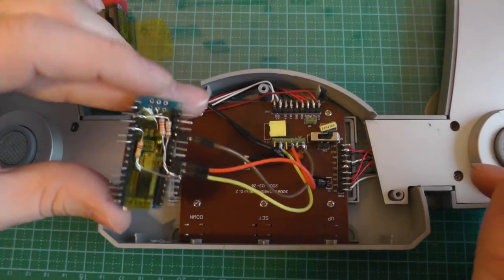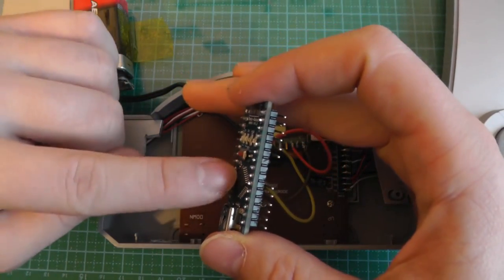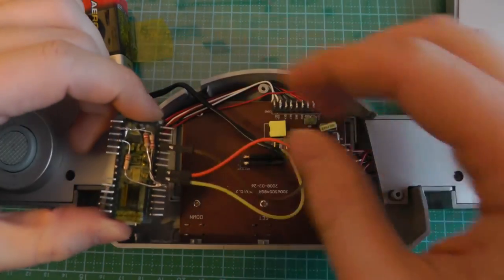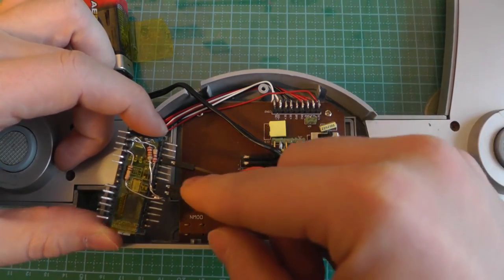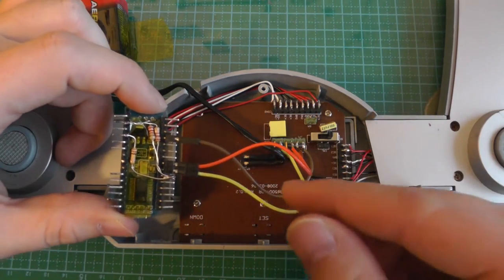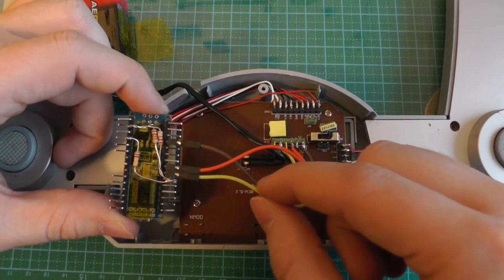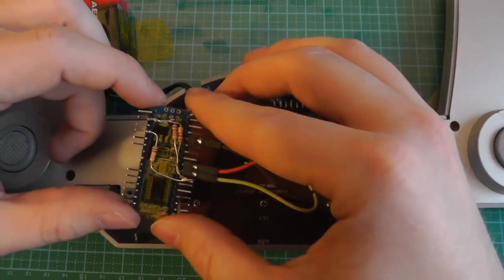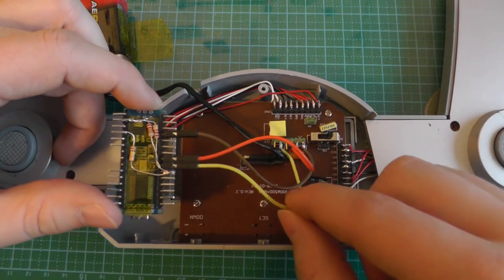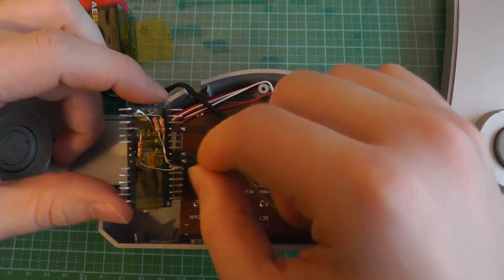This Arduino Nano operates at 5 volts, so the pins on the Atmega are at 5 volts. Now we've seen that this signal is 3.3 volts, but 3.3 volts crosses the threshold, so the 5 volt pins still detect that it's high. But the problem is that the 1 volt cable doesn't cross the threshold. So we cannot simply use a digital I/O pin and check if it's low or high, or use it as a trigger.